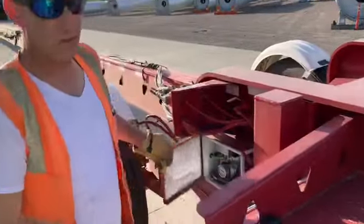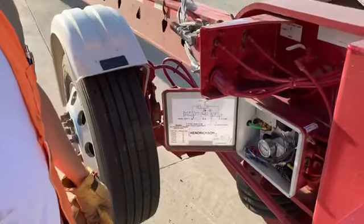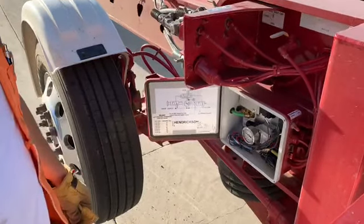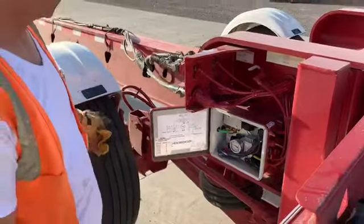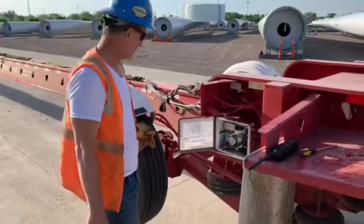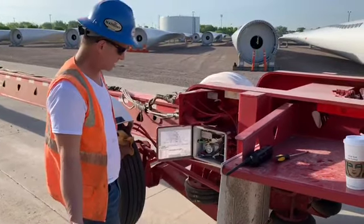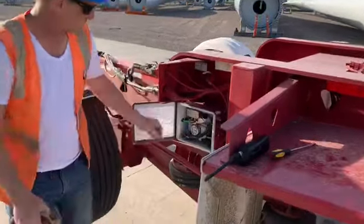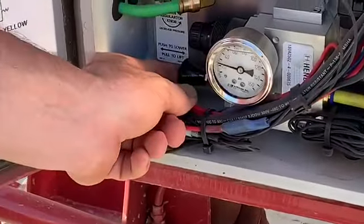The weight on those current blades — you're looking at about 38,000 pounds on the drives, which we can get permits for 40 and under. Therefore you don't have to put your axle down; however, I recommend it — it takes the bounce out considerably. It's a simple process, as simple as hitting this switch right here and pushing it in and relieving.